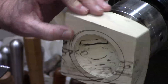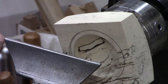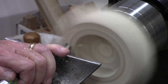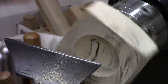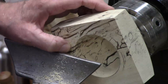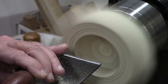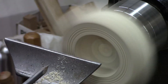Now I'm going to work on the beads. I probably should have faced off this side first to make sure it's clean along the rim. I'll take one pass with this finishing tool. Now I've got to decide what kind of bead treatment — I like beads, so I think I'm going to put a couple on there. I'm going to mark it with bead grooves first: one there, maybe the next one a little bit smaller, and a third one about the same size. I'm going to use my detail gouge — three-eighths inch detail gouge — to roll over those beads.